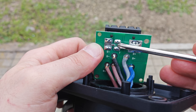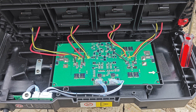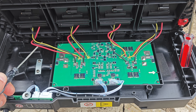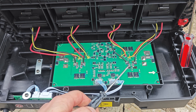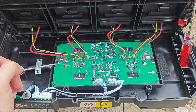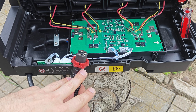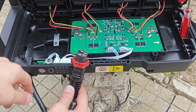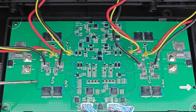This component is the resistor used for battery identification. When you open the backpack you'll find one really big and relatively sophisticated control board. The board consists of two identical parts. Battery slots A1 and A2 are connected in parallel, as are B1 and B2. The output of each battery slot goes through two MOSFETs — eight total — which can be activated and deactivated by the control board. Inserting batteries won't give voltage on the output cable until you press the on/off button. Each battery slot also has a current-sensing shunt resistor; if no power consumption is detected, the backpack will automatically shut off after some time.